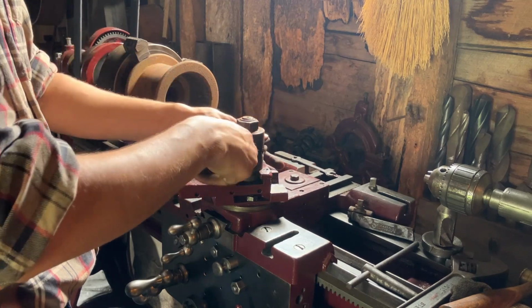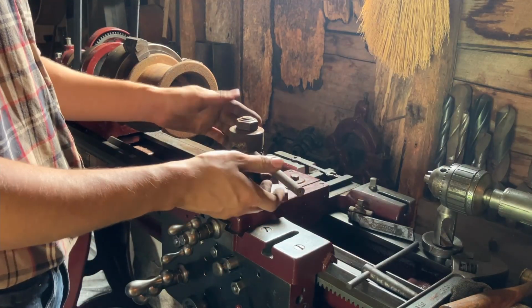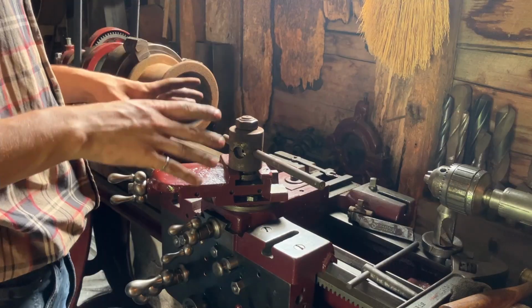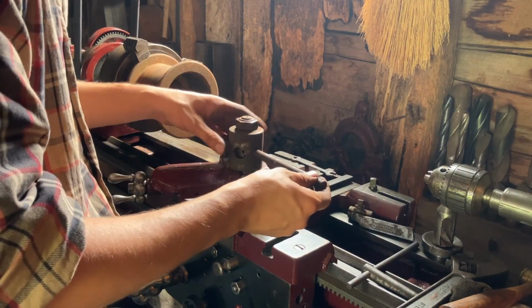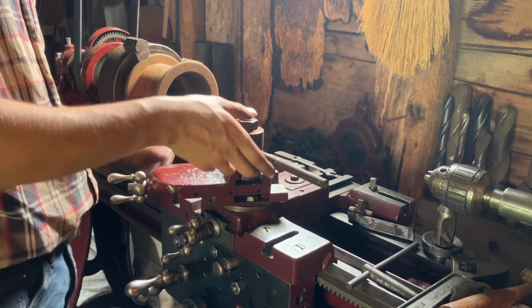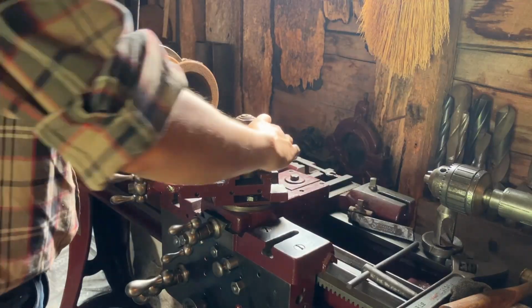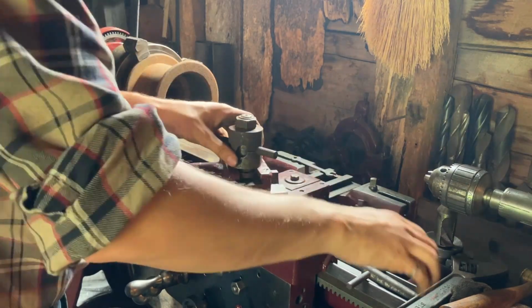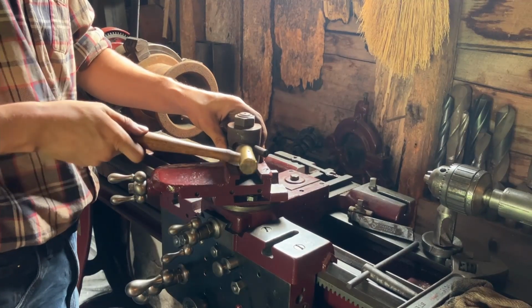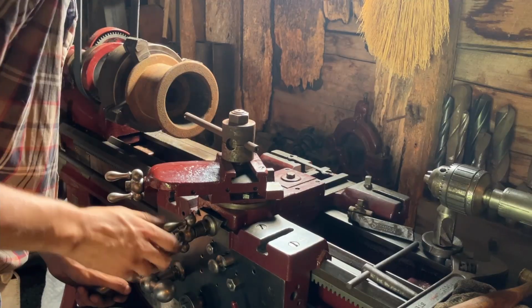The only thing that really you can't set so easily on this is the trueness to center. So it basically has to be the right holder for your machine. You can put shims if you know, but I'm going to try with this. Let's see how it goes. So I'll just spin this guy around and kind of get it so that it's square. Doesn't have to be too square because the carriage is always square with feed, but I don't want it rubbing on the wall.